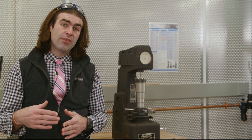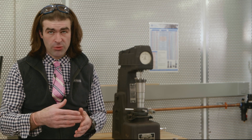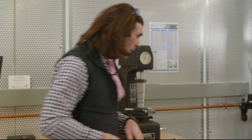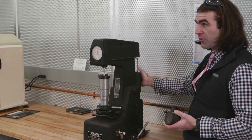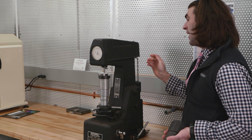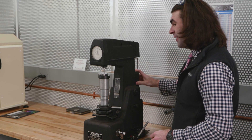There's a limited band of accurate measurements that each kind of test can take. Rockwell C with the diamond indenter uses 150 kilograms of load — that's not the weight of the masses on the back, that's the force applied to the tiny penetrator after mechanical advantage. The machine has three weights on the back: the top one is 50 kilograms, the second is 40 kilograms. So you can run 60, 100, or 150 kilograms. Taking the 50-kilogram weight off leaves us with 100.